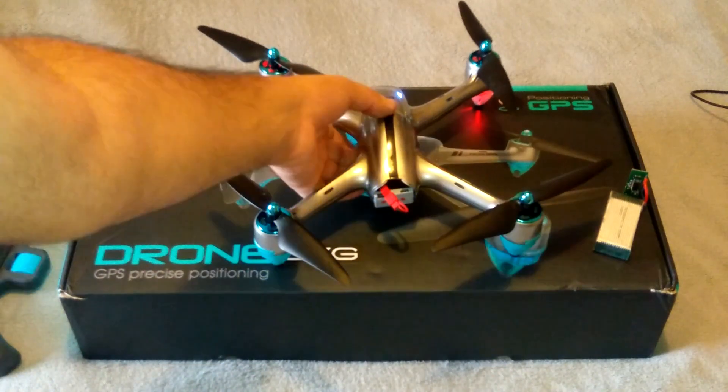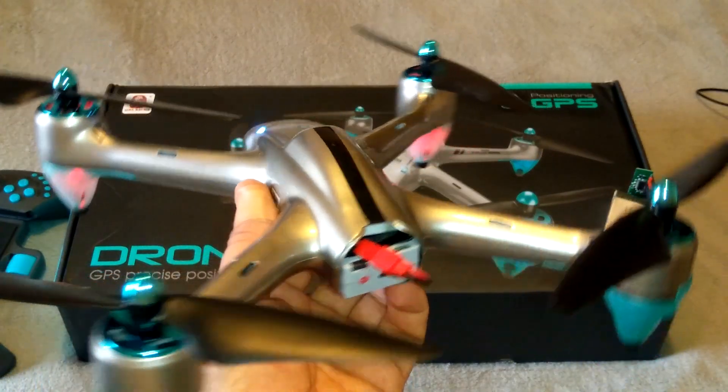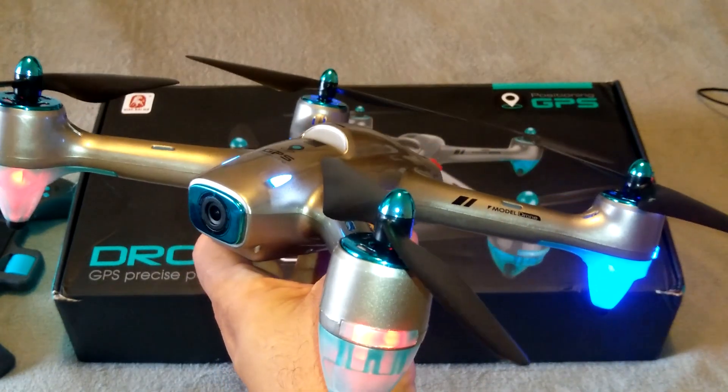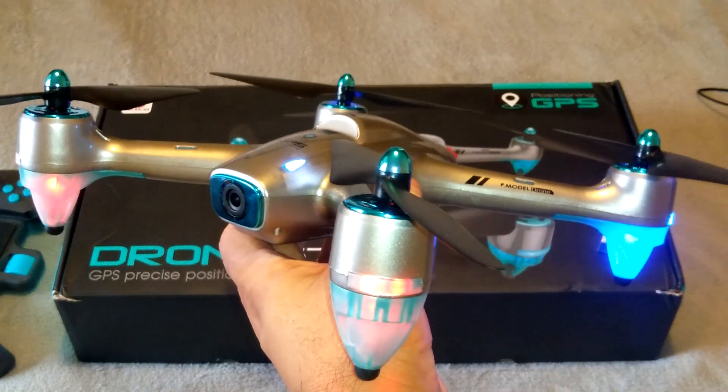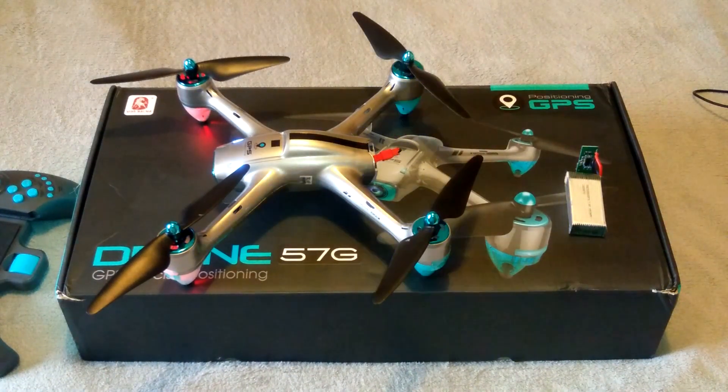What I'm going to do now is take this for a test flight with this battery mod and see how long it flies for. The original battery in my initial review flew for 18 to 18 and a half minutes off a 1000 milliamp hour. With these batteries being 1450 milliamp hour — and a higher voltage — I should get well over 20 minutes. It's going to be interesting to see, considering it's nearly an extra half battery increase in milliamp hour.